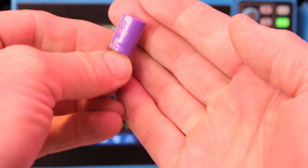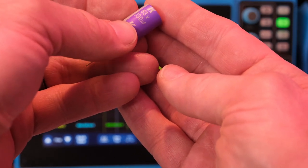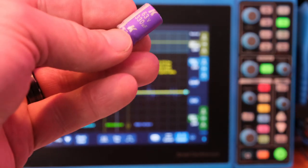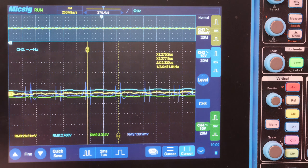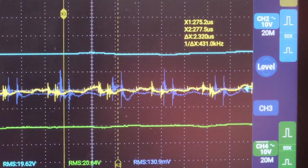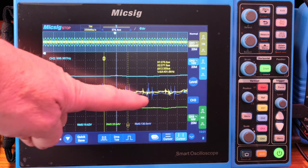To tackle the ripple we need something at lower frequency. Here's a 63-volt, 330-microfarad solid aluminum conductive polymer capacitor made by Kemet. This should be a much better capacitor for that low-frequency ripple — the spiky stuff is high frequency, but the ripple is relatively low frequency. We still have our purple reference waveform. Let me make sure I have the polarity correct because it is polarized — that would be a very loud bang if wrong. Bringing up the signal to the same level — that looks much better!